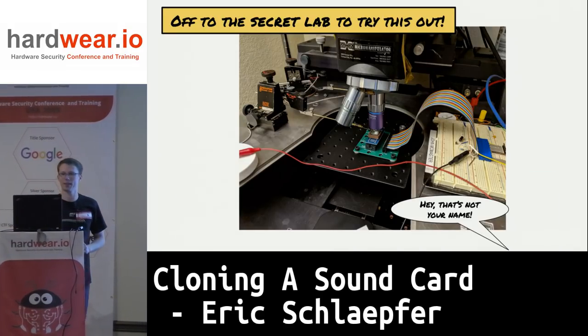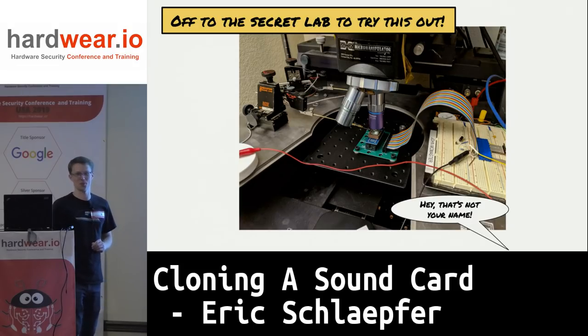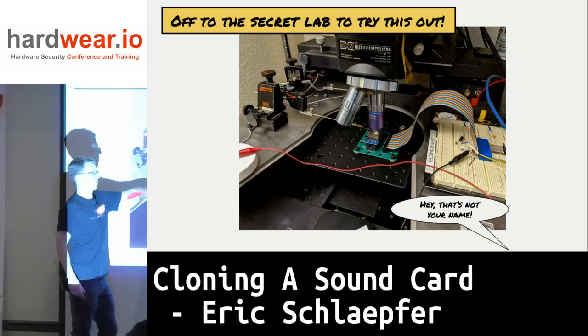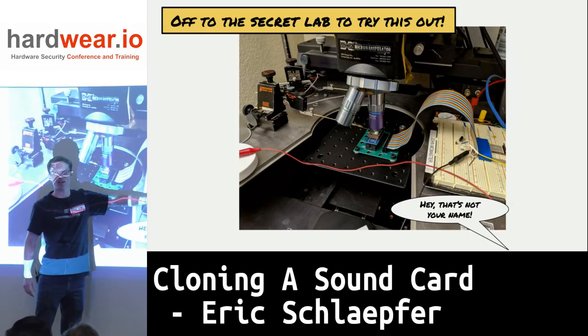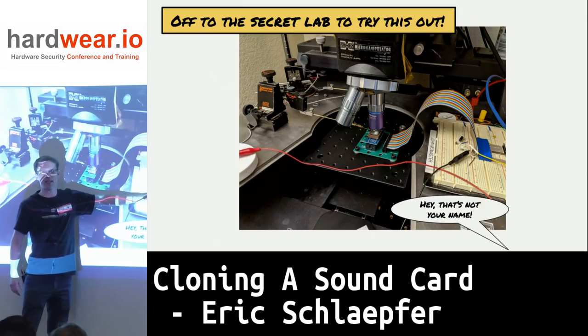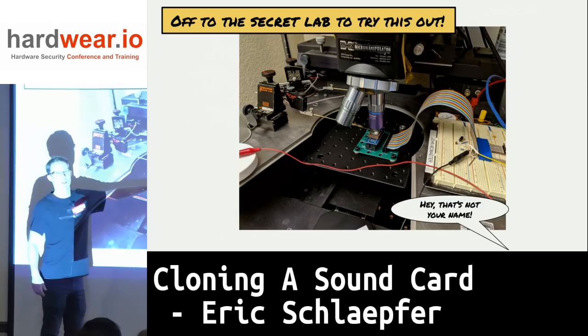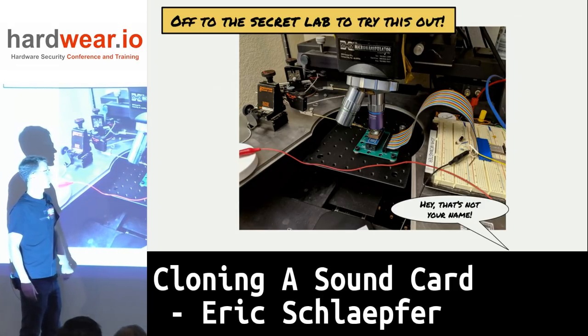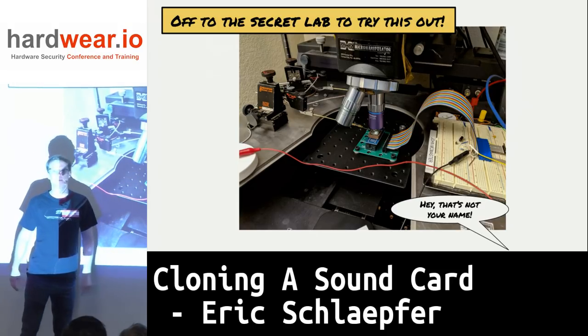I would probe them right before that NOR gate so I can take advantage of the sense amplifier and the rest of that circuitry. So here we are at the secret lab — John McMaster's house — with the chip in a socket with a very long ribbon cable, and at the other end is a 4 MHz oscillator. There's a lot of parasitic capacitance along the way that serves the purpose of load capacitors. And then I've got a single tungsten probe coming in to the decapped chip.